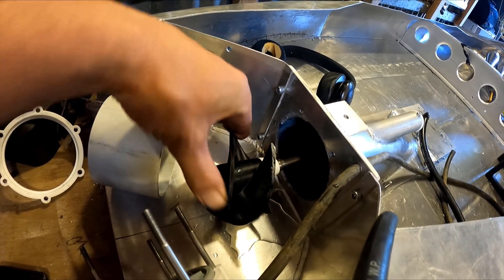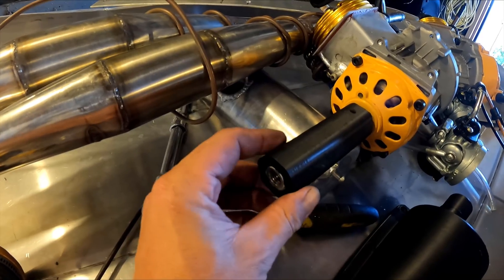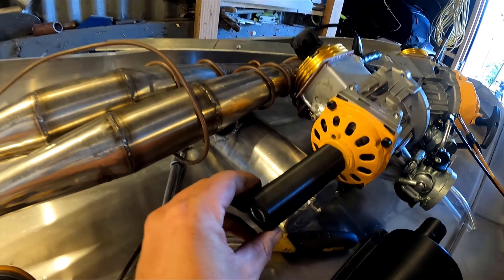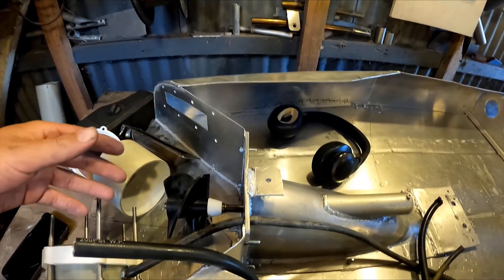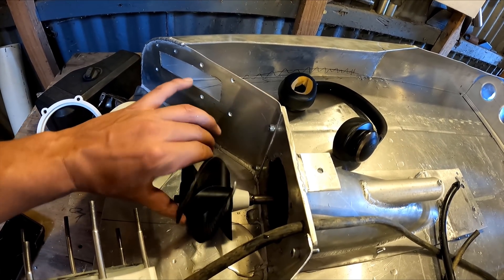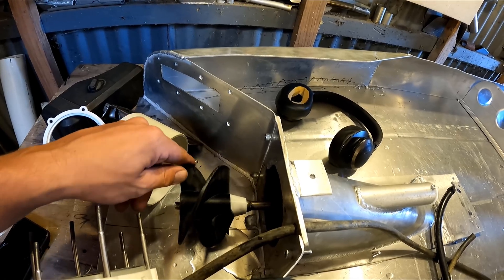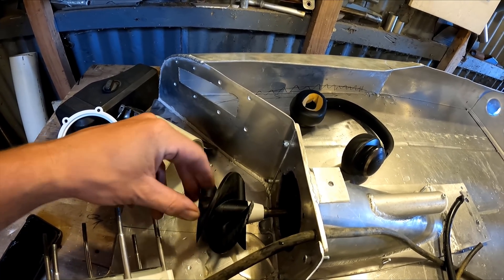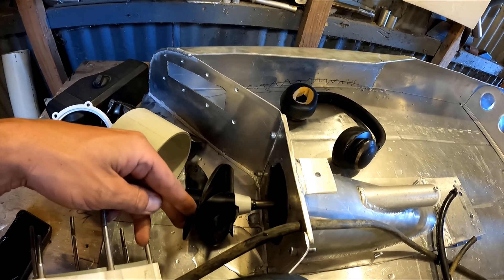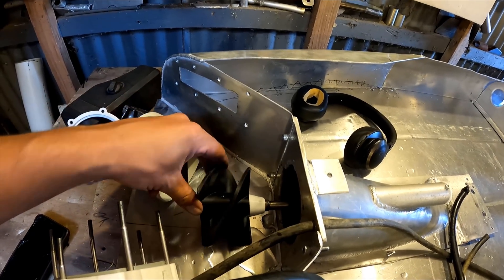The other good thing is the impeller held up — I thought it was going to break but it didn't. The plastic coupling held up as well. I never think it actually went full power on both motors, but I think this impeller is a little bit too aggressive. Maybe I'll make it with one less fin — it's got three fins — or I'll change the pitch. I'm open to suggestions guys, leave a comment what you think I should do. We learned a lot from that little test. Thanks for watching, see you next time.